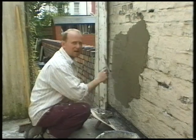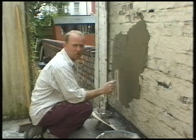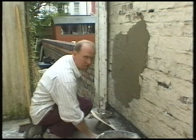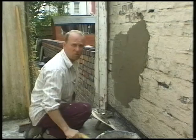When you've finished applying the sand and cement to the wall, get it roughly flat. Don't over-trowel it — don't keep going over it because it draws the water to the surface and that tends to make it fall off. Wait a few minutes and then buff it up gently with a float and then go over it with a wet sponge.